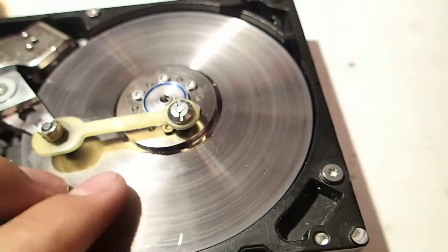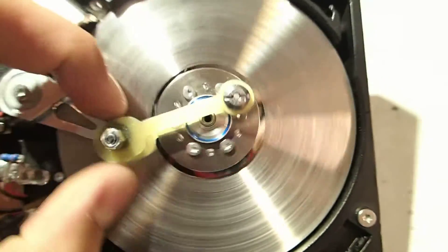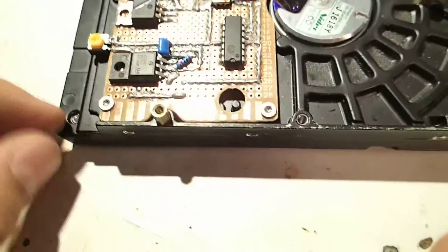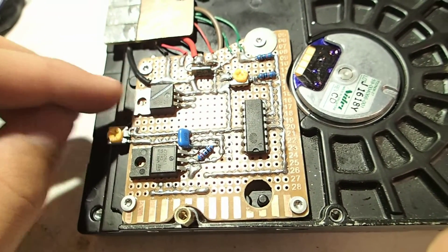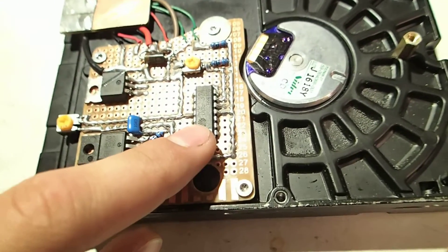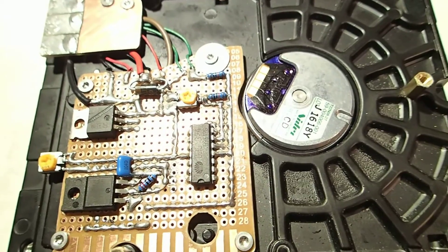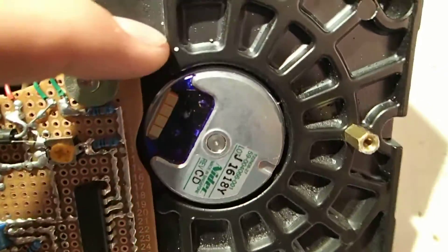There I just have a little pin going right into the hard drive spindle, a little screw right here, connected with a bit of PCB. Here are the power inputs. This is a very simple circuit — just a voltage regulator with a voltage adjustment. That's the MOSFET that switches the coil on and off, and that's a comparator circuit using one of the four op-amps in the chip. There are the two voltage dividers, and this sets the threshold for the coil. Here's just the power input board — a bit of copper clad with three slots in it. The actual motor isn't connected in any way, shape, or form.